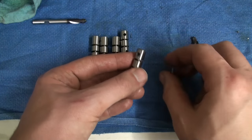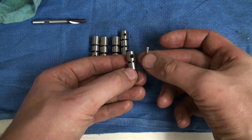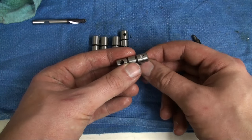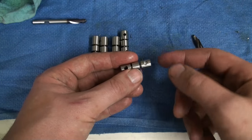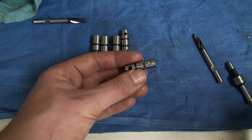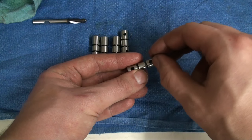Okay, here you can see a pair of rollers with the counterbore hole, and this is the screw where I turned down the head to 4 millimeters. As you can see, this goes below the surface and looks quite neat. It doesn't build up, and doesn't need a big old counterbore like a cap screw or a regular screw. So that's the reason why I modify the screws.